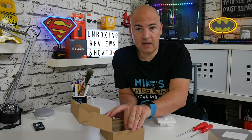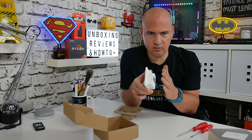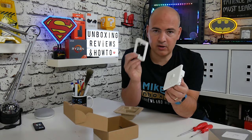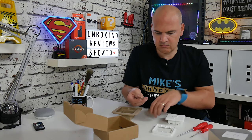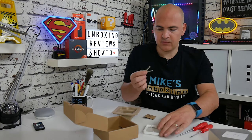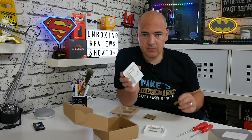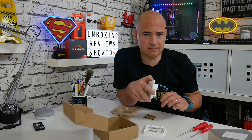What we'll also be making use of in this installation is the spacer. Because these switches do contain technology in the back of them, they're a little bit deeper than your regular switches. So we're going to be using a 10mm spacer to bring the switch out from the wall a little bit. If you've got a 30mm or larger back box in your wall, then you won't need this. I've only got 25mm ones, so I do need this spacer. We'll also be using the longer screws, which are included in the package. Additionally, we'll need an additional earth cable, which will connect the earth from the switch itself to your earth in the back of your back box - this is very important and necessary to keep it safe.